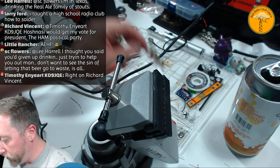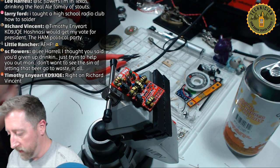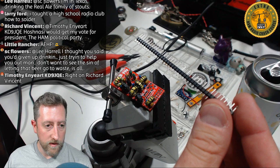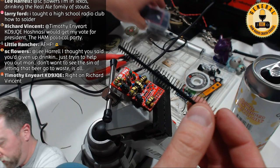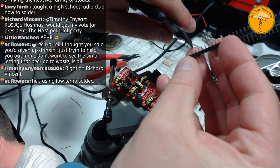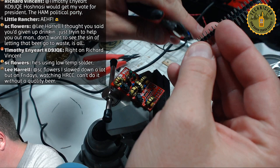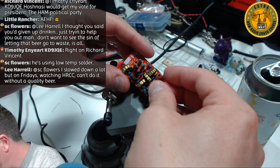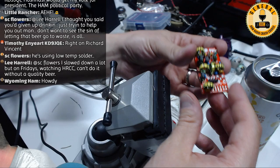This is the part of the kit where they missed something — they did not provide any pin headers. These are cuttable headers used to connect jumpers. This kit calls for a 1x3 and a 1x4. I'll count out three — 1, 2, 3, snip — and then 1, 2, 3, 4, snip. The 1x3 goes here and the 1x4 goes there. Then pull out the handy-dandy needle-nose pliers to get them seated.